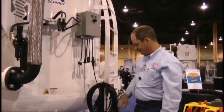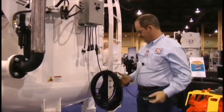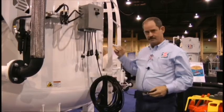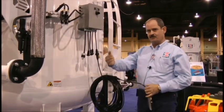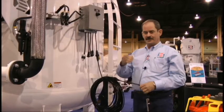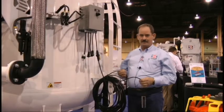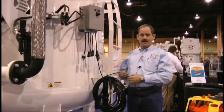Another point of interest on this vessel, along with our G2 Electric Deadman — a new product on the market — is our dragon cable. The issue in the industry with electrical cords strapped to blast hoses is that the dragging and pulling of the electrical wires with the blast hose would abrade the cords. If the cords get abraded to the point where the wires are raw and can touch, you could easily have a nozzle light up when you didn't want it to. This dragon cable is a polyurethane cable that we have had in blast rooms for long durations on steel grated floors with no abrasion effect whatsoever.